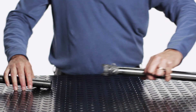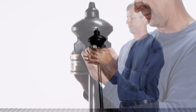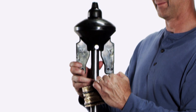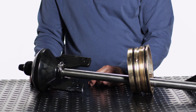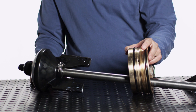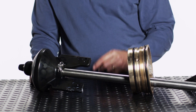Remove the upper stem and coupling. Turn the lower stem and main valve assembly upside down and gently tap it on a piece of wood to remove the main valve seat ring. This is easier to do if the hydrant is fully open when beginning the removal process. Leave the seat ring on the lower stem to be installed later. If using a new seat ring, remove the old one and place a new one on the lower stem.